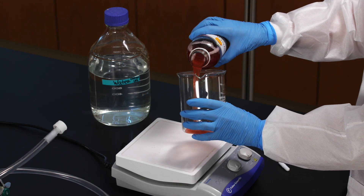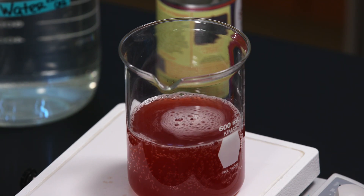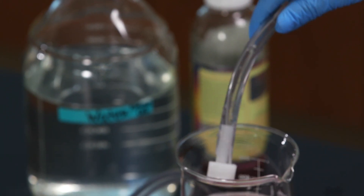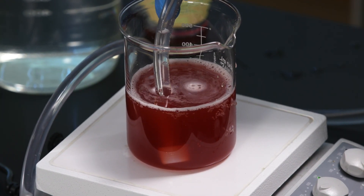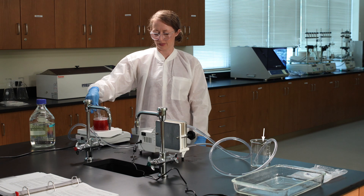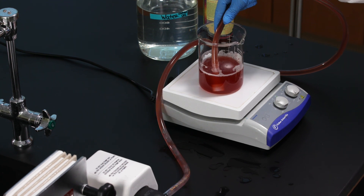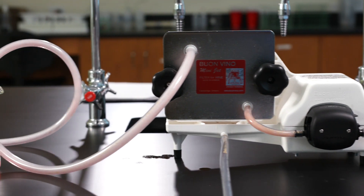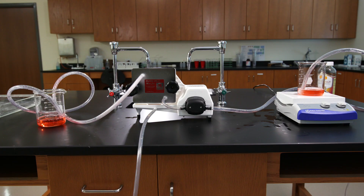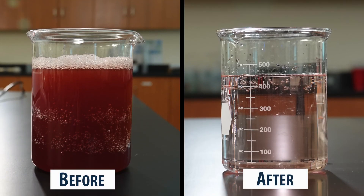Check the pads and snug the hand wheels if there are any leaks. Pour the kombucha into a beaker with a magnetic stir bar and place it on a stir plate. Insert the intake hose — it's the one with the anti-sediment tip, which helps keep the tube from getting clogged. Put the tip into the bottom of the beaker without bumping into the stir bar. Place the outtake tube into a clean collection container and start the unit to run the filtration cycle. Take a look at the results. Remember what the kombucha looked like before? Now it's much clearer. The filter pads did the trick.